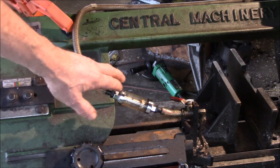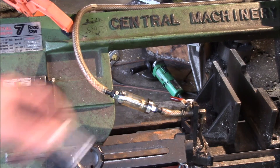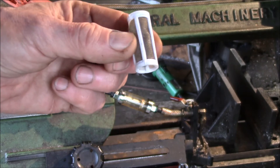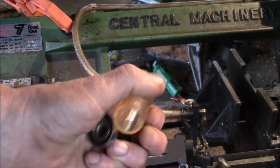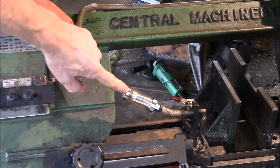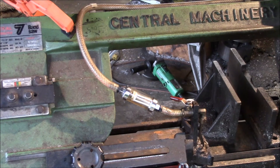One of the things I added was one of these clear reusable fuel filters. I just cut the line right here, put a couple of hose barbs on the end of the filter. Those filters have a little stainless steel mesh filter element — they're not meant to filter down to the micron level, just to catch big chunks as a pre-filter — and I find this works really well. The end screws off, you put the filter element in, you have the clear glass housing, and screw everything back together. Coolant comes in, fills up the glass tube, gets filtered through the mesh, and goes out — keeping the tip from getting clogged, which is really nice.